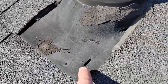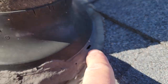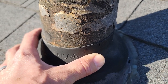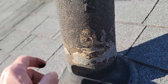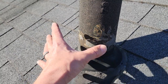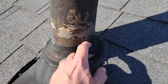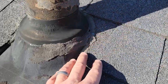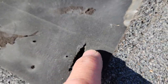I'm not a fan of plastic pipe boots because they degrade like this — you're actually getting holes through them. Usually this is the weak link, and those don't typically get a lot of water flow — just what's hitting the pipe boot itself or the pipe running down. If those go bad, a simple solution is shove a new one on. On any new install, just put a second one over it so the first covers the original, keeping sun rays off so it doesn't get brittle and crack like this. When it's low like this, that's where the water rushes the roof and goes down into these — they're just deteriorating, falling apart. Not good.